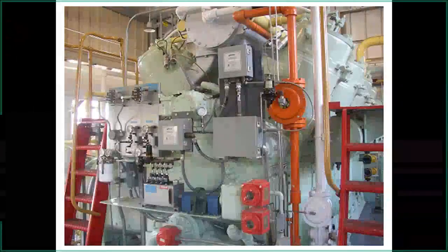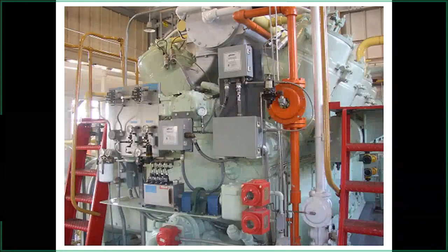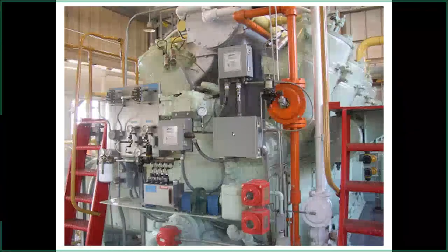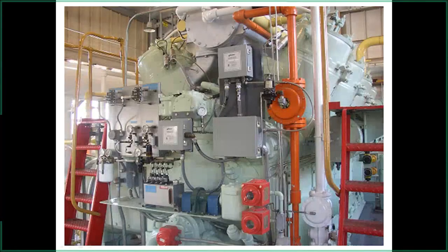This layout shows a Cooper-GMV. There's a junction box where all the primary wires come in from the coils. On top of that is the diagnostic box — this little cable is where we get information off the primary wiring off the N and V lead. This would be a 16-output module — you can see there's only one cable coming off the side. All boxes must be grounded to the engine and to earth ground, which is very important for correct operation.